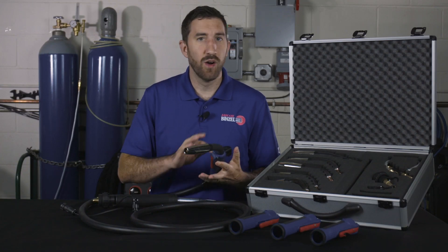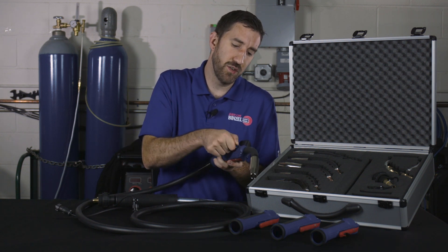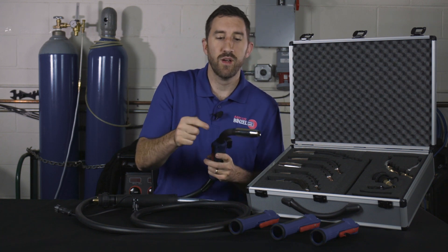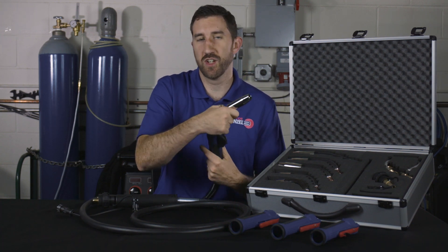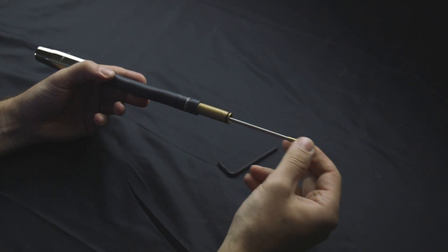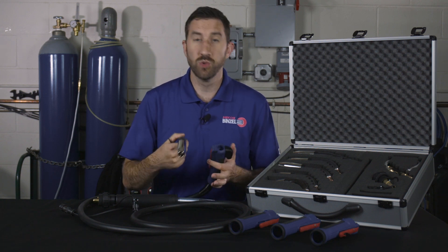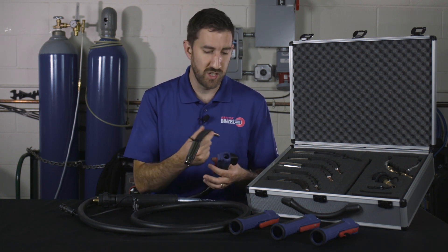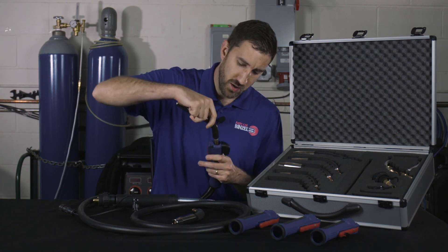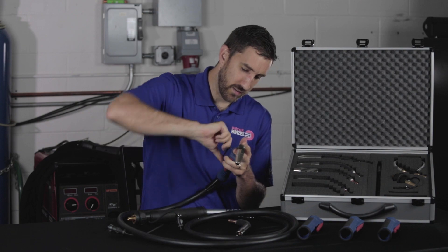Let's start by switching your swan neck out — really easy to do. There's a little nut that sits right here inside the handle. Just get the hex wrench in there, quick quarter turn, you can loosen it up, and then you can rotate that neck 360 degrees no problem. If you want to swap the neck out, just simply pull it out. Best to use neck liners if you're going to be doing a swap like this, but if it's the same tool center point, same length, you can just keep your wire liner in there. Then simply switch your neck, get it to the position that you want, and tighten up and you're ready to go.